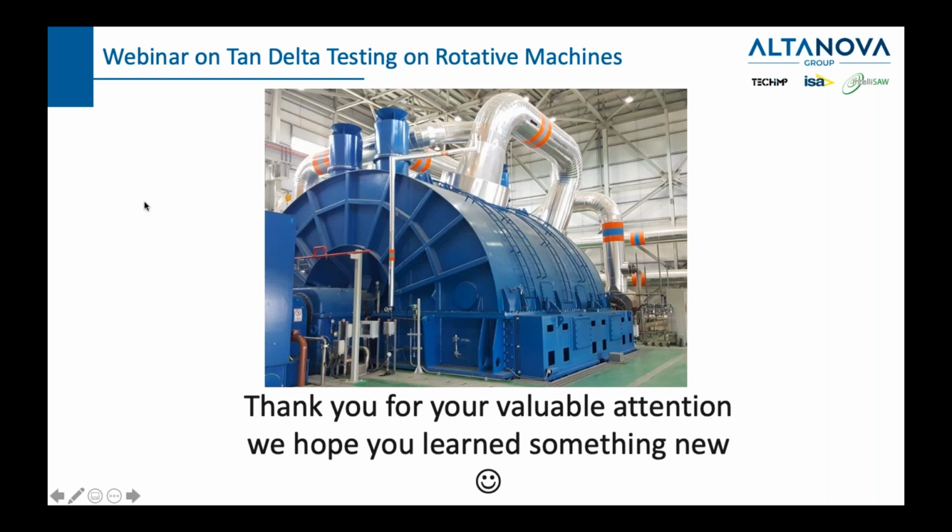Mr. Harold asks: how frequently should I test the tan delta for a hydroelectric generator of 58 megawatts, 5 years in operation? I think you should test it right now, and then depending on the result, if the result is good, repeat it every time you have a yearly checkup. I would test tan delta every 1 to 2 years, for example, but everything depends on the number you receive right now. If the number is bad, then you might need to check every 3 months.